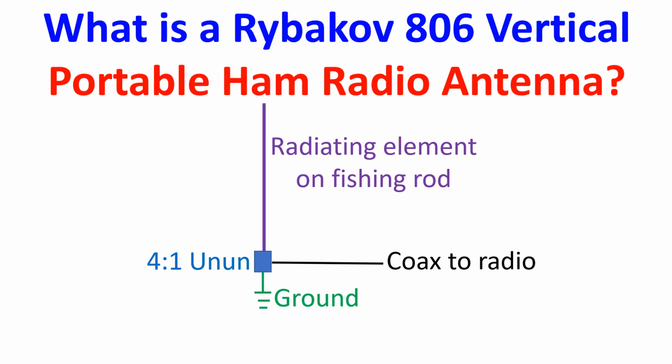As it is a non-resonant antenna, an antenna tuner is a must. Built-in antenna tuners of modern radios may be enough. A wire length of 7.6 meter can cover from 7 MHz upwards. If 3.5 MHz is needed, wire length has to be increased. Some sort of a ground or radial has been recommended. WB3GCK mentions a 25-foot radiator and a 25-foot radial. Extension of radiator to 53 foot for 80-meter operation was suggested.